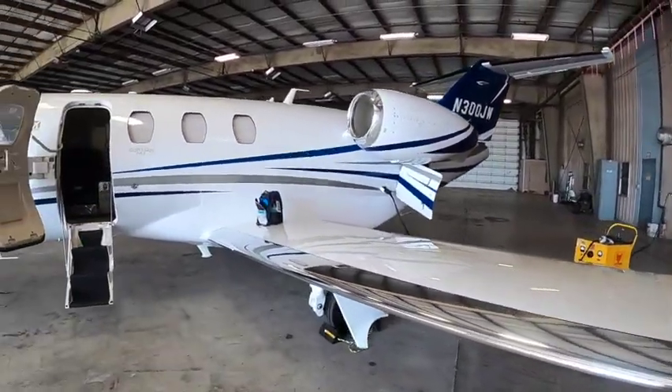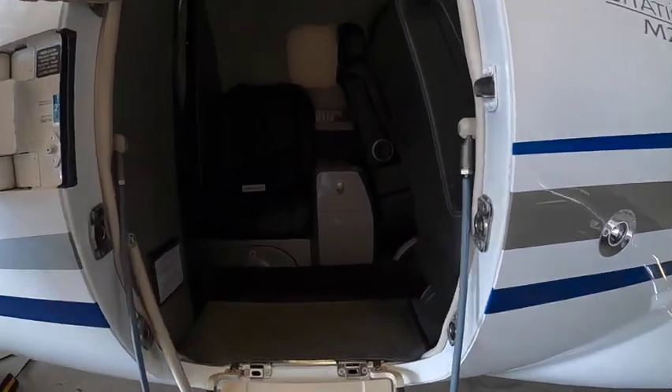Now let's go into the airplane and get my SD card out. It's kind of dark — I've got my windshield covers in to keep it cool. We're going to take out the bottom card, which is our connects card, get out the SD card and put it in the bottom slot. Just make sure the little tab is slid forward — it is. Slide in very carefully.